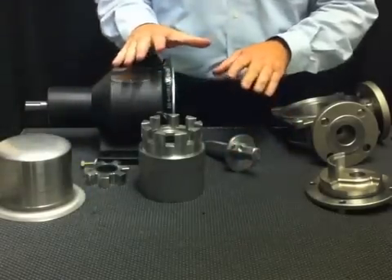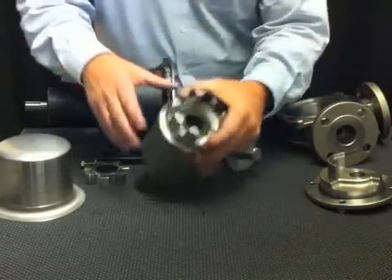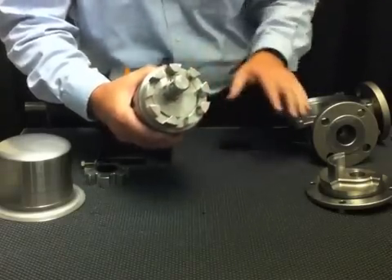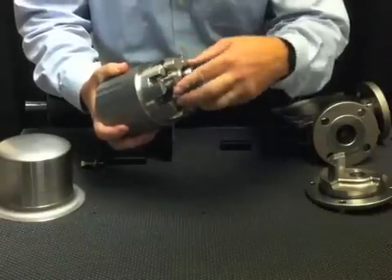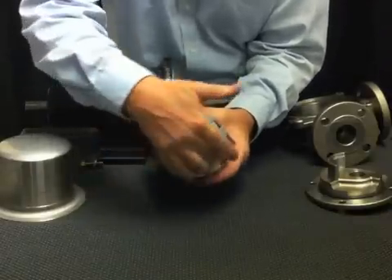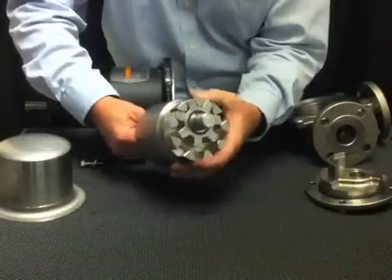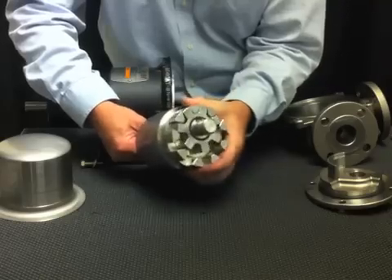In spite of its innovative features, the Envirogear is based around a very fundamental pumping principle — that of an internal gear pump. We have a rotor gear which rides on the ID of the casing and an idler gear which rides internal to that rotor. As the rotor turns and the gears turn within the pump, liquid moves through the pump, and as the gears mesh near the discharge port, the liquid is forced out. That's the same pumping principle that has been used in internal gear pumps for a hundred years.